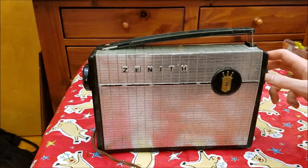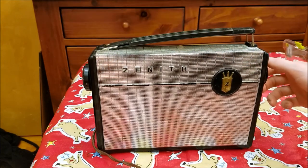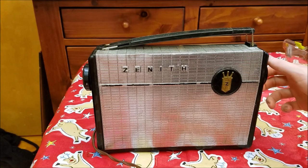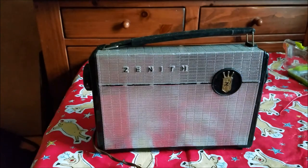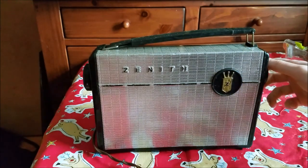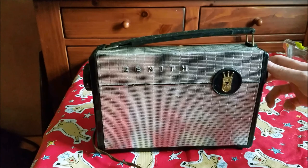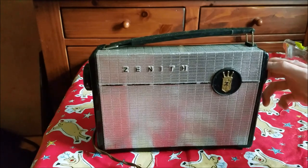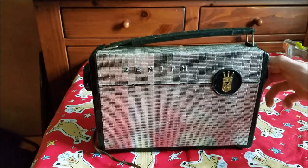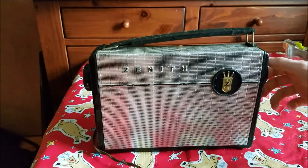The radio is now receiving stations. There's some light interference. I noted that pop at the end of the band — that was two of the plates in the capacitor rubbing together, so it was bent through a little bit. Now it's fine.